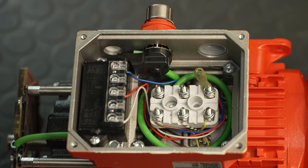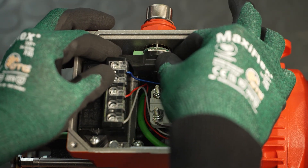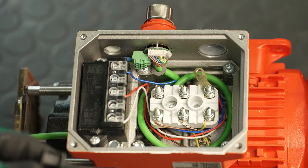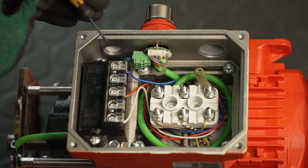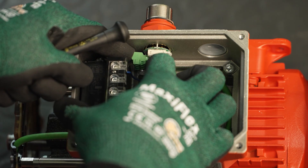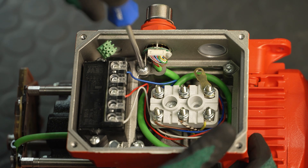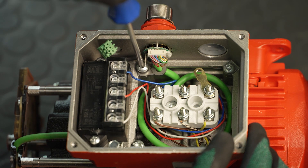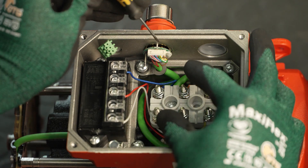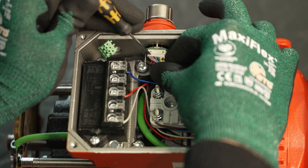If the motor is equipped with an M23 connector, remove the fan as usual and loosen the built-in encoder. The differences are located in the terminal box. First remove the protective cover of the M23 plug connector on the inside of the terminal box and remove the screw terminal with the shielding from the pin strip of the printed circuit board. Now loosen the screw underneath and remove the socket with the encoder cable from the connector board. Make sure that the metal clamp underneath is removed and that the connector is not subjected to excessive tensile forces, as this may result in damage to property.